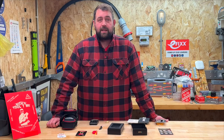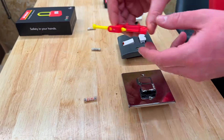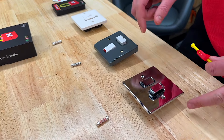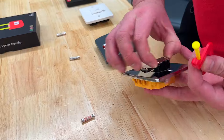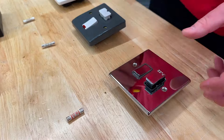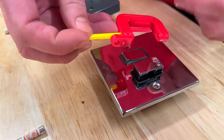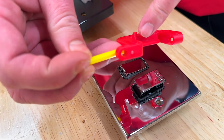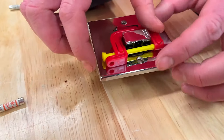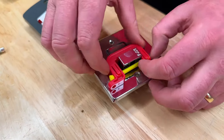Now we've been through the kit and seen what's supplied, let's have a play. What I've got here is three switch fuse connection units all with different fuse carriers. I've taken the fuses out already on each of these so it should make life a little bit easier. If you just take a quick look on here you can see there's a little lip on there. So on this particular fuse carrier I have to go around the outside and clamp it in, which means I can't push that one down.